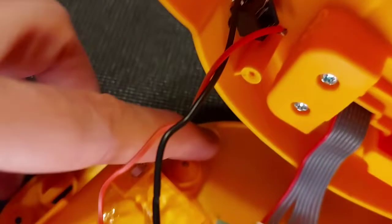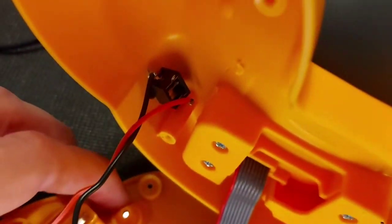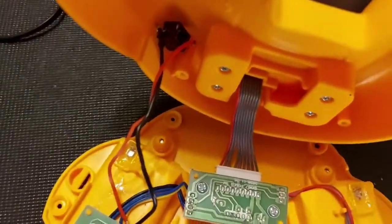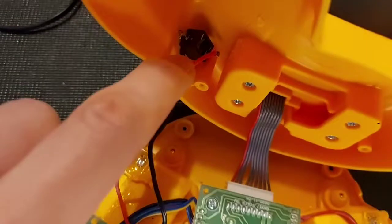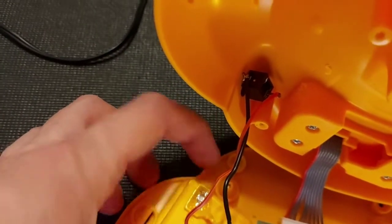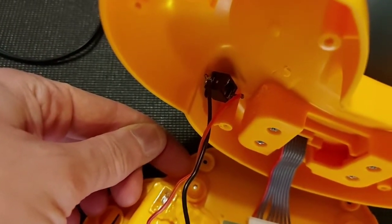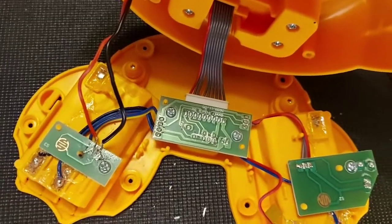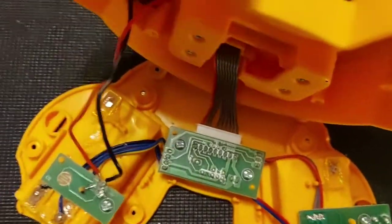One last consideration is that the type of ports I used take up space inside the toy. I had to really carefully match things up and transpose in my head where there's going to be enough space for the jack to fit once it's closed up, because the two pieces are going to come together quite closely. It actually sits high enough that it flies over the components here — it fits right about here, doesn't conflict with anything, and the wires lead really easily to the spot they need to go. Once it's closed up, I'm not worried about it pulling or having other issues, because screwing it shut means there isn't really a lot of strain on the inside.